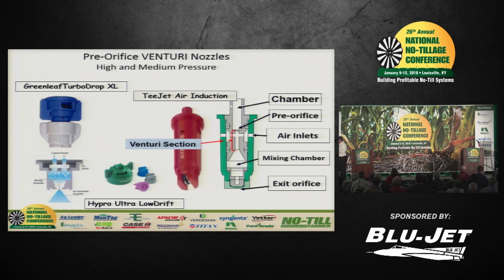This is in reverse. You've got spray going through the nozzle. It hits there, it gets into a high-speed scenario, and it creates a vacuum, a pressure difference, so the air inlets allow air to be sucked in. So as I tell most of my audiences, these nozzles suck. And that's a good thing, because they're sucking air. Then it puts it into that mixing chamber, combines the air and the spray droplets together, and spits them out through the exit orifice.